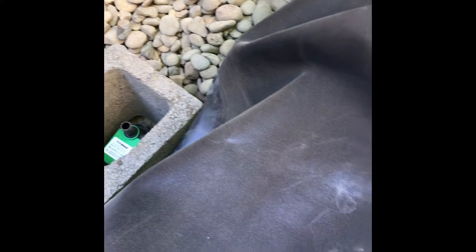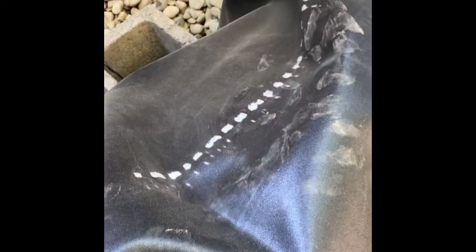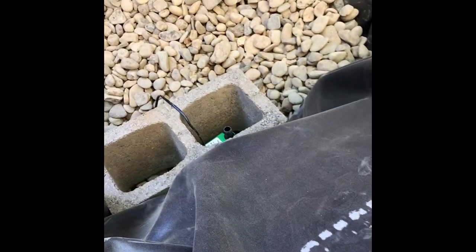The reservoir is surrounded by this rubber liner — I think it's a Firestone rubber. It's actually one of the more expensive kinds; it's a 45 mil, which is fairly thick. You can get the 14 mil, but they're very thin and much easier to puncture. I also put an old piece of rubber down at the bottom to help protect it from any punctures.